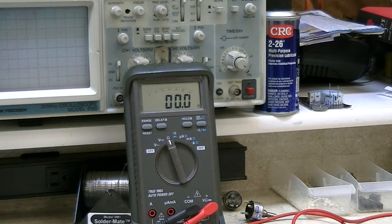It's to measure the temperature of the copper in those particular areas. On the one we use for the thermocouple rods, a few years ago it blew a hole right through the copper. Normally the copper rods are welded in at around 1,200 or 1,300 amps, but the maximum in this unit is 3,000. The company originally tried to blame the operator, but I started doing some troubleshooting and found that the potentiometer was junk.